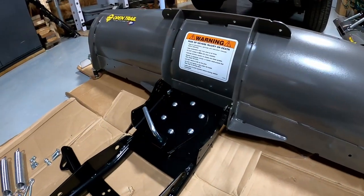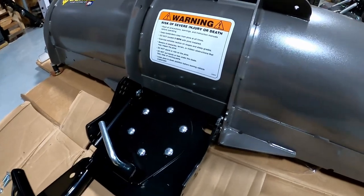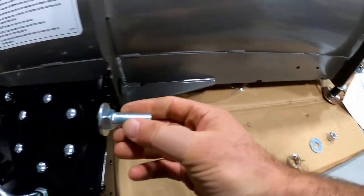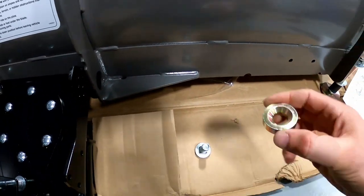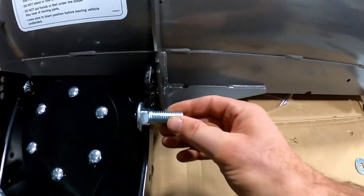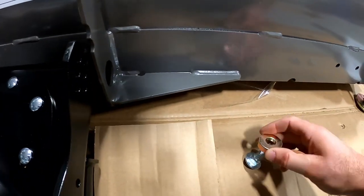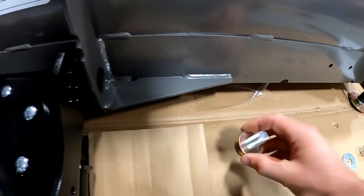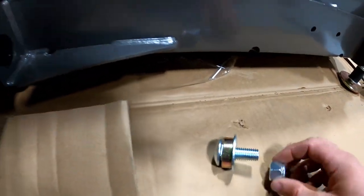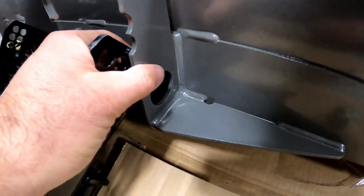Both of our plow shoes are now on. I went ahead and stood the blade up and attached one side of the mount to the blade. It's just a carriage bolt that comes through this way with a tapered washer — you want to put the tapered washer on the inside, because as the carriage bolt comes through it might stick in a little bit and this will fill that gap and let it slide in deeper. On the outside we put the washer and then just the nut, and that's exactly what you can see here. I'll get the other side put on as well.